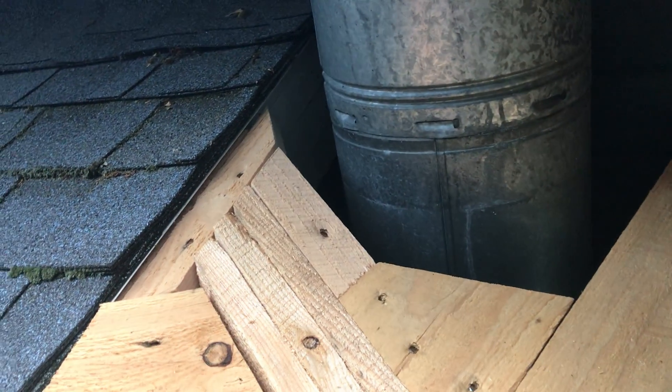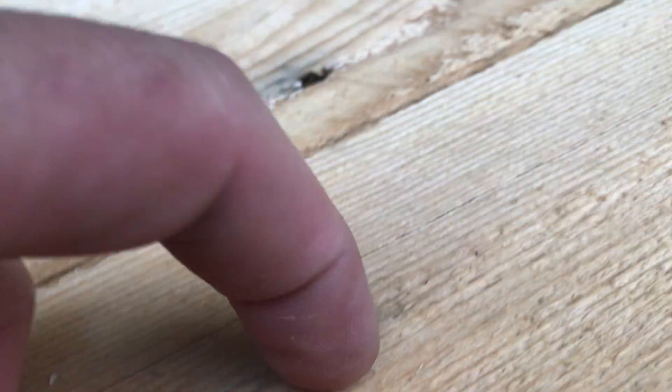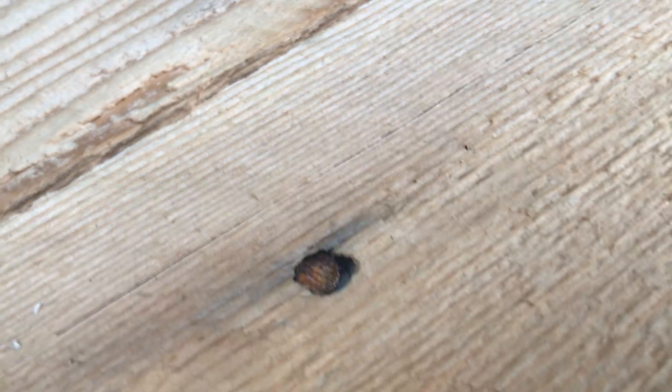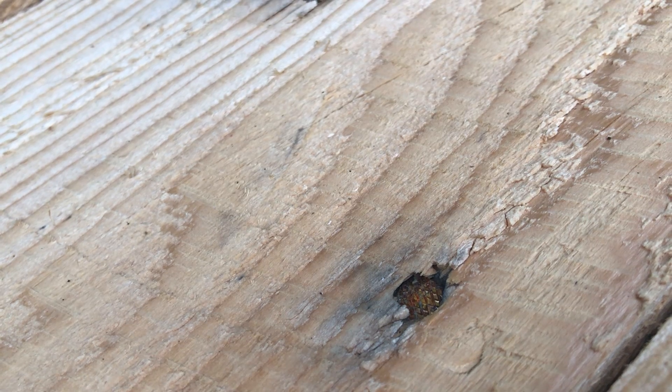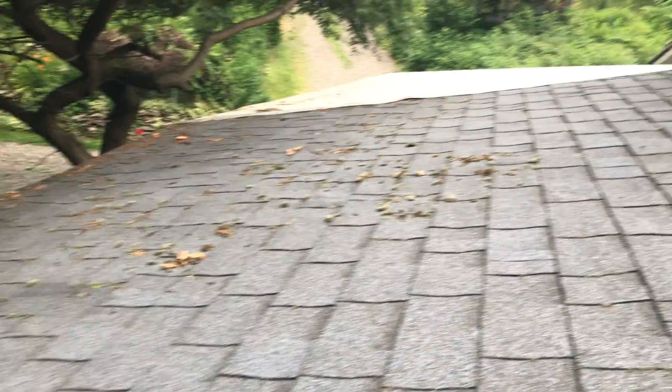I'm not sure how I'm going to do the aluminum around the chimney — I may go down sideways a little bit and then overlap. I'm still debating that. I'm not going to start the aluminum tonight, but I'm all ready. Besides handling rain well, I like how the rough lumber bounces back when you drive nails in — you get a good eighth to a quarter inch difference between the nail head and the wood surface. That's very important because the aluminum must not touch those nail heads, as that will definitely cause a leak.